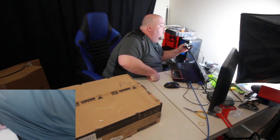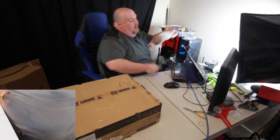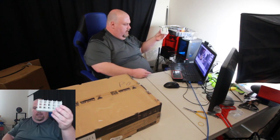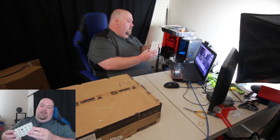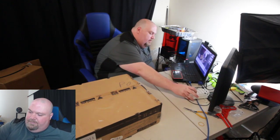Whenever I get a new printer, I always throw one of these crates on the printer to test it out. Unfortunately, this one had some issues. This was the first print on one of the AlphaWise printers, and it split off. I was still trying to figure out how to dial in this material. But the print actually came out pretty good, except it splits. Later prints have not had that problem. I just had to increase the temperature a little bit so that the layers would adhere to each other. Generally, this is one of the very first prints I put on a new printer. Greg from Florida calls it the Terrain Benchy, and I agree with him. That's one of the reasons why I really like it.